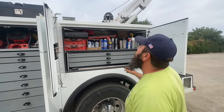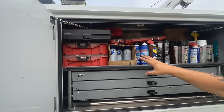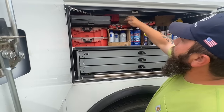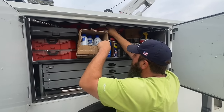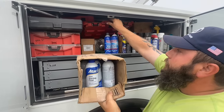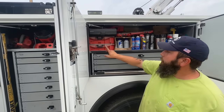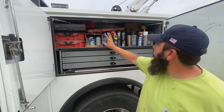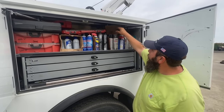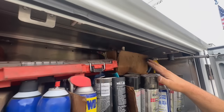In this department we have two drill and tap sets — this one goes to a little bit bigger sizes, but I like to have two complete sets in case you break a tap. This has electrical fittings in it, and behind that we have our crack detection spray. You spray the dye on there and you can detect cracks in metal. Grease gun, spool gun. We've got brake clean, grease, paint, WD-40, and different types of chemicals. In the little box above, stuff most likely to spill: Loctite, anti-seize, silicone, and things of that nature.